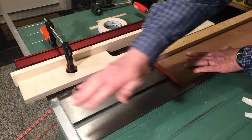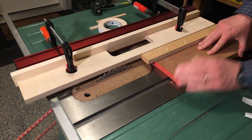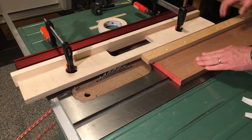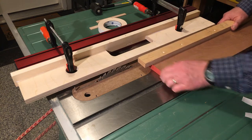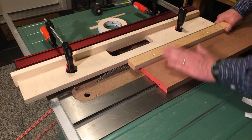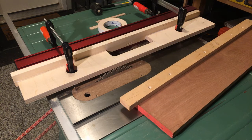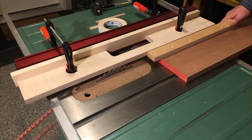And then we're going to slide the cut through that way. Off behind the camera you can't see it, but I do have some outfeed support that's going to catch this piece as I exit the rear of the table saw so that it doesn't flop down. And the good thing about the L fence is that if you do wobble, you're not going to mar the good part of your work piece — all you have to do is come back, start all over, and move it down. As long as you keep the rub fence tight to the L fence, you're golden. So I'm going to stop jawing and start sawing. Here we go — make some sawdust.